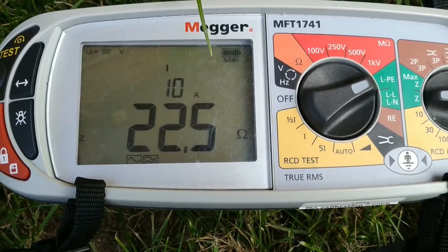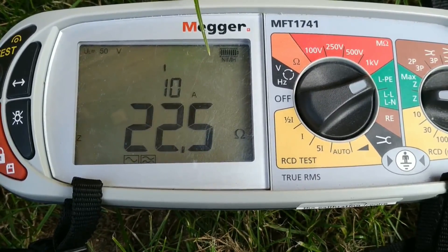Now of course 22.5 ohms is a lot higher than 16 ohms, but that does not mean the circuit has a huge resistance of around 6 ohms — obviously it doesn't. What we're actually testing here is the full Earth loop impedance path. This is a TT installation, so the supply comes from a transformer on a pole some way down in the next field. We're actually testing the electrode at that transformer location as well as this one, and of course the current flowing through that whole path including the copper conductors. So although it's higher than the individual electrode, that's to be expected — we're measuring both electrodes in series, which is perfectly fine.